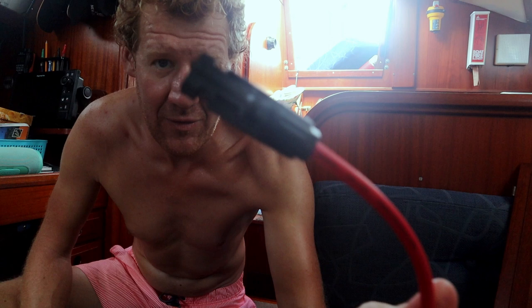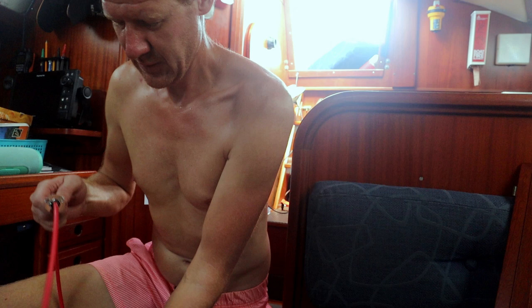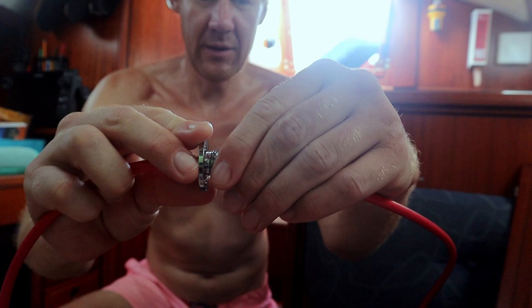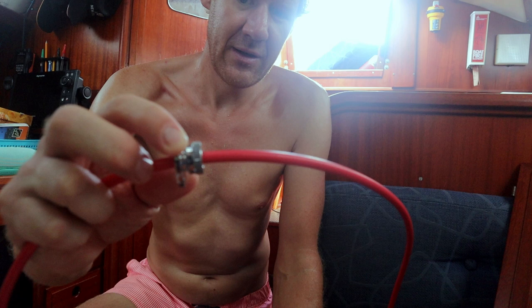the inlets to the boat, because otherwise I have to detach it and mount it again. And then you will end up with the piece that comes against the hull, then the conical rubber one, and the cap you just twist and turn. And if you pull that tight, it's a complete watertight seal.